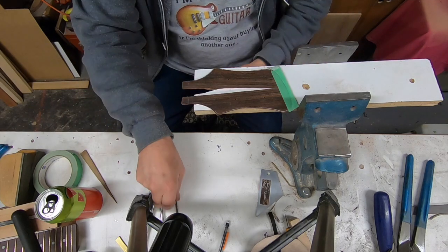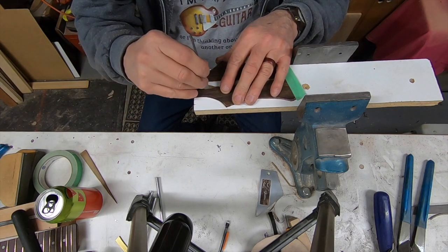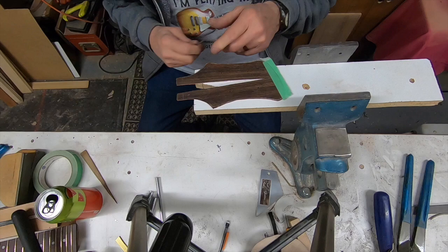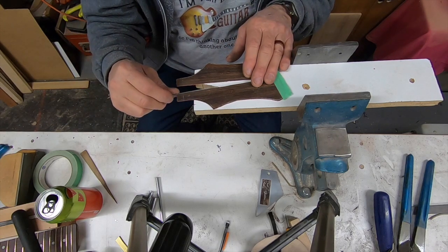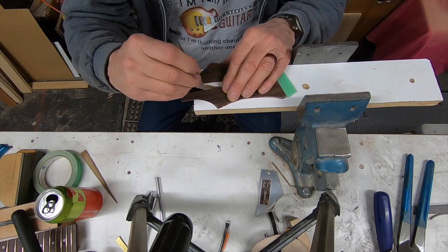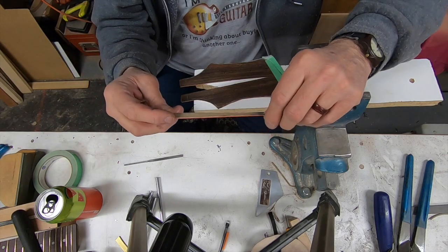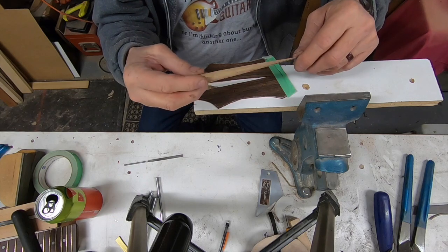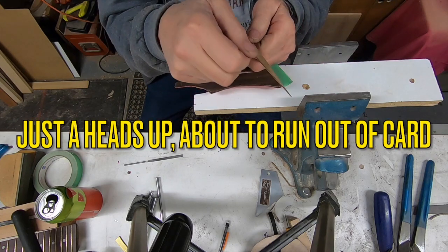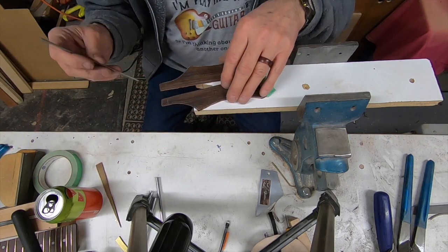The wedge is cut out. I'm going to go ahead and file up in here and get that straightened out as much as possible — take a popsicle stick with sandpaper on it and file this way so I can get a straighter line. This is the basic idea. Having razor-bladed that out of there, I have a bit of an undercut on one side and a little bit of an overcut on the other, just because of the way I hold the blade being right-handed.